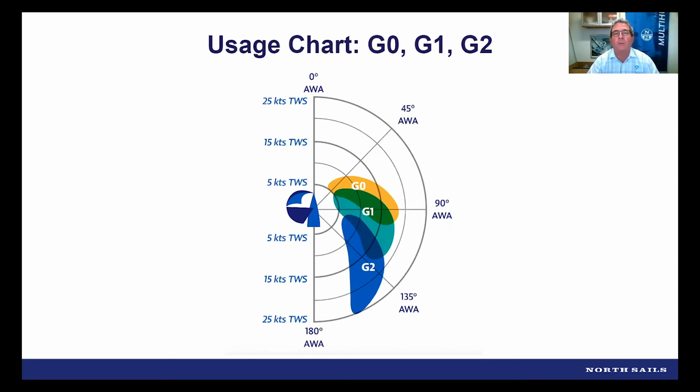that's when I want to stick at what I consider, well, I won't name brands, but maybe some of the higher range of furlers, just because of the greater load capacity, some of the experience that they've got with some of the offshore racing stuff. Let the racers break the stuff. Cruisers just want it to be easy, simple, and know it's going to work. If we stay within the limits and match the furler to how the sail is going to be used, you never have to give them a second thought.